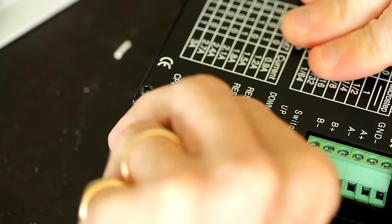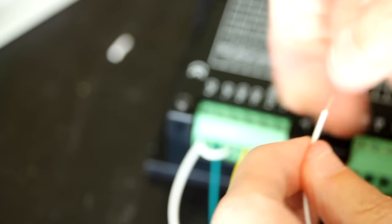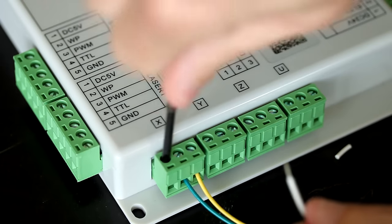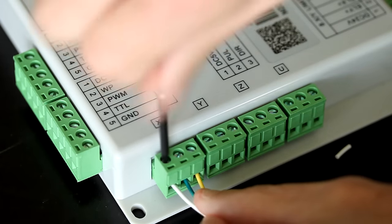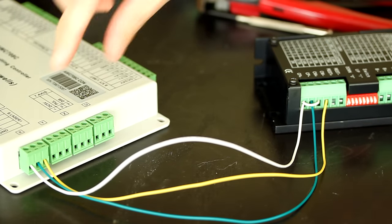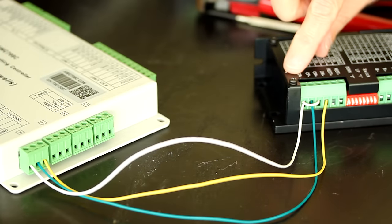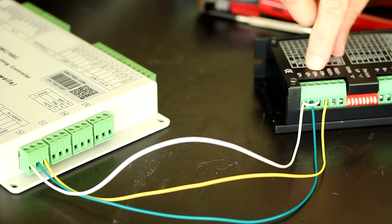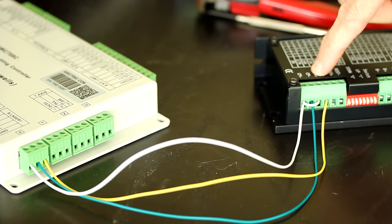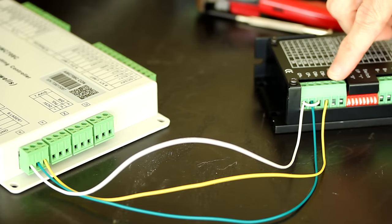Make sure the jumper is in there correctly. Strip the other end of the white wire to go to the laser controller, taking it to the number one terminal — DC 5 volts. To review: we've connected the X-driver digital side to the laser controller motor axis output. The positive 5 volts goes to Cp-plus and Cw-plus. The pulse terminal (terminal 2) goes to Cp-minus on the driver. The direction terminal (terminal 3) goes to Cw-minus on the driver.